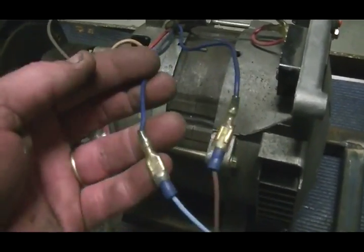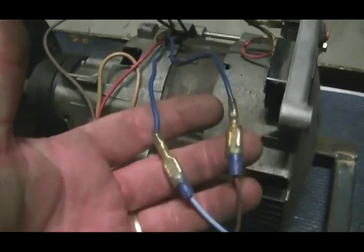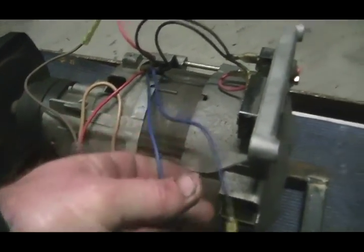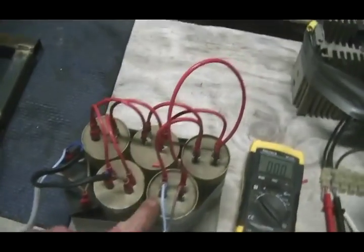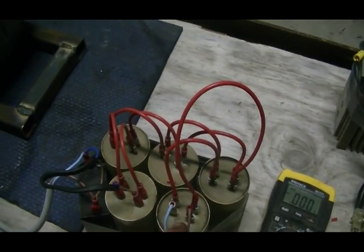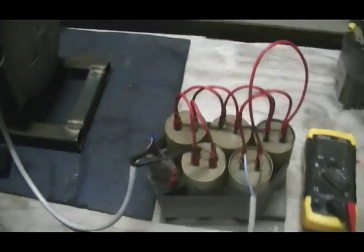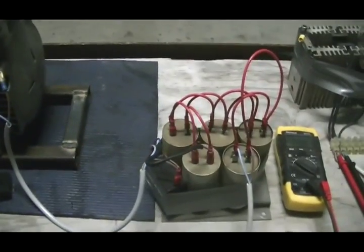In an electric motor, this would be included in the run windings to chuck half the run windings out of phase, but this is a totally separate circuit altogether — these two windings are in no way joined up; open circuit. That's a pretty good discovery. In fact, I'm going to get my petrol generator, which is a three kilowatt, and looking at this I reckon I can draw an extra kilowatt off that generator without using any more fuel. Cheers from the Tin Men.